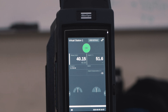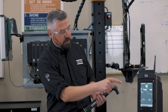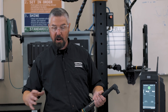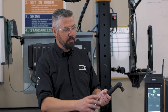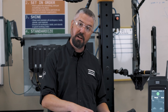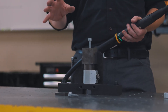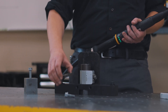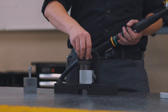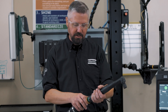This number is really critical because it tells us about the quality and the consistency of our parts. If you keep an eye on this as you're running a big batch of production, hopefully that number is going to be really consistent, because when that number changes it tells us that something might have changed in our parts. So as our baseline, we got 51 degrees of angle. Let's take our long bolt out and put a thinner part with a shorter bolt and see what kind of angle it has for the same torque value.